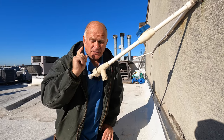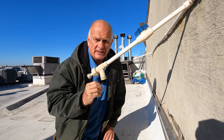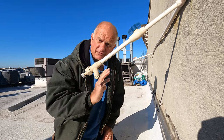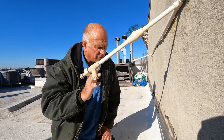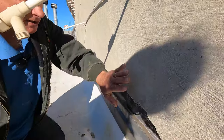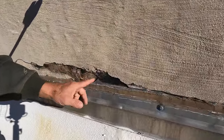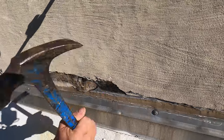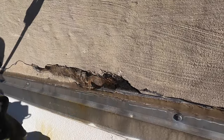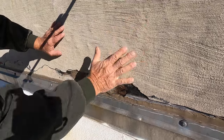This video is about how to repair flat roof leaks. 90% of any flat roof leak is from flashing. Let me start showing you all five areas. The first one is they've stuccoed this wall and they stuccoed over tar — look here, there's the old tar — so they smeared tar on this wall before they stuccoed it.